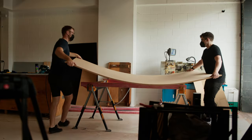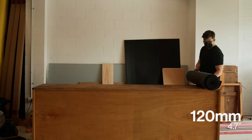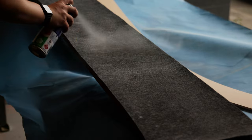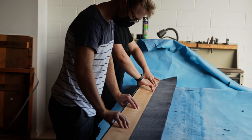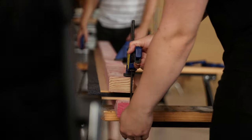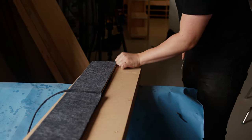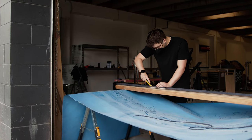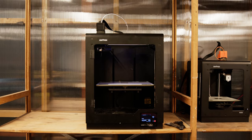To make all of our dividers we're using 6mm MDF and 3mm felt. We've got a full sheet — we're just going to rip it down into 120mm divider sections, cover them in felt using spray glue, and then chop them down to size on a drop saw. Stretching the felt over the MDF isn't too hard, but for longer sections an extra pair of hands is helpful. We clamped these down between some 2x4s while the glue hardened and trimmed off the excess with a craft knife.